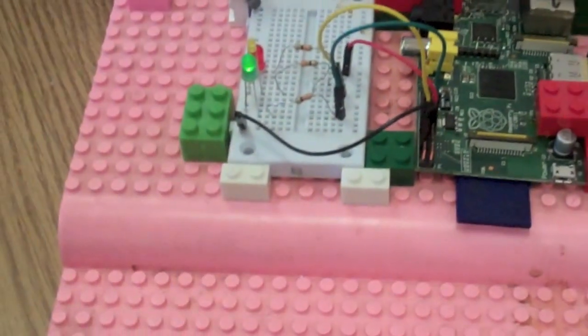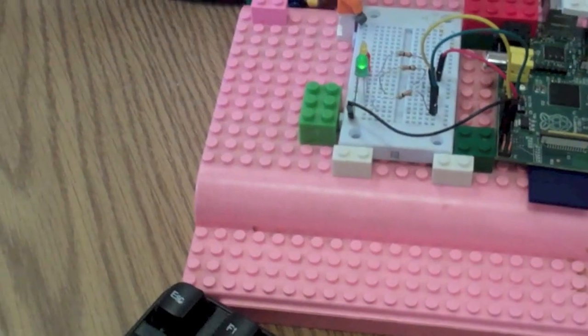You're going directly from the pins on the Raspberry Pi straight to the LEDs — through a resistor. Very important: you must put a resistor in there, otherwise you won't have a Pi for very long. But it's very simple. You can see there: three resistors, three LEDs. As long as you've got the resistors in there, you're okay.